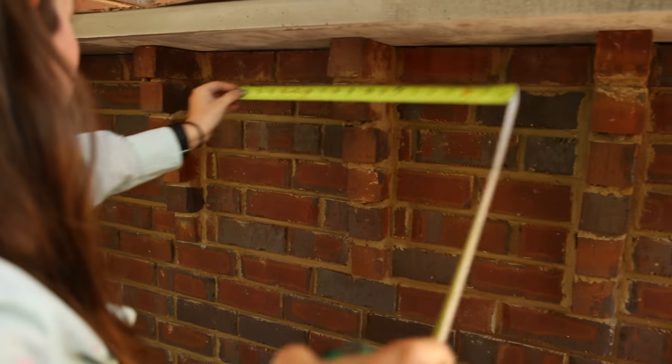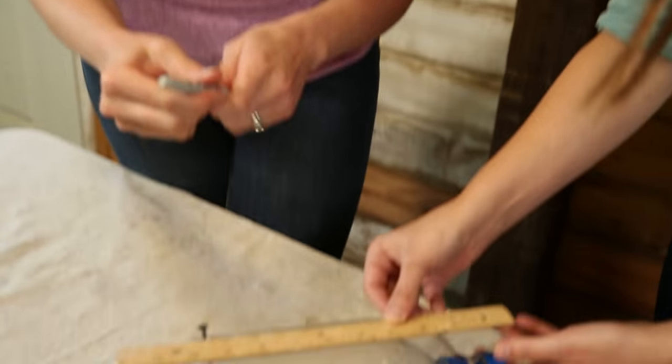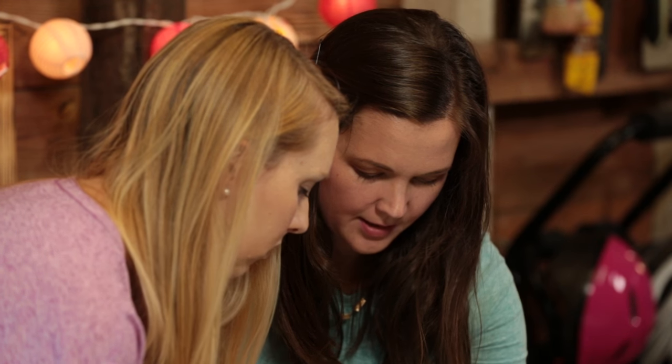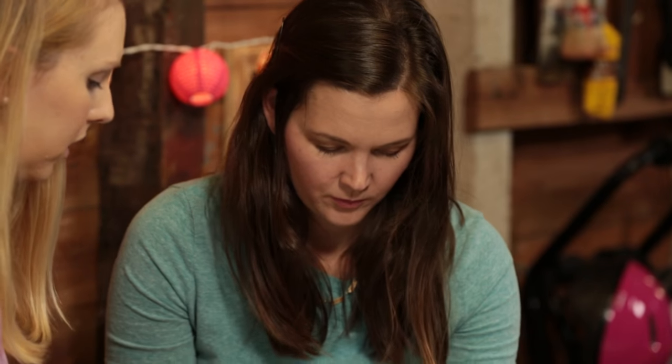The island that the pendants are going over isn't very big. We're doing three pendants because underneath the bar top there are three corbels, and we're going to match the corbels above. We want to make sure all three are even — if we see them from afar and they're uneven hanging up there, that would be terrible. You don't want them to be so short that the light bulb is hanging out and distracting from the fixture itself. Nine and a quarter inches seems like a good size. One thing to consider: the concrete will shrink from this mark while it dries, so you may want to add about half an inch.